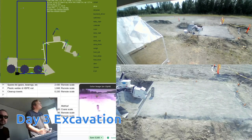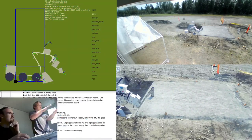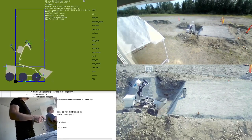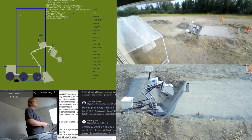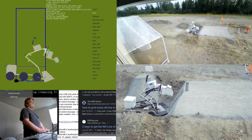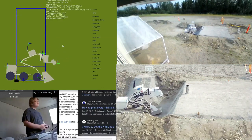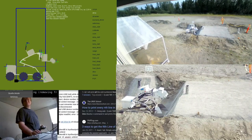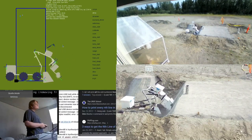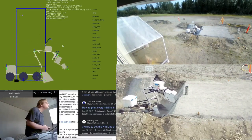We also have a narrower drum. This was early in the contest — we were using the narrow drum. The narrow drum can cut through very hard material. Our concrete came out substantially harder than we had planned and intended. We were using the narrow drum to get dialed in with the cutting process. Here, Brandon, my student, is making nice, careful, smooth cuts. He's having to use a camera to guide the cut location because the head is really narrow.